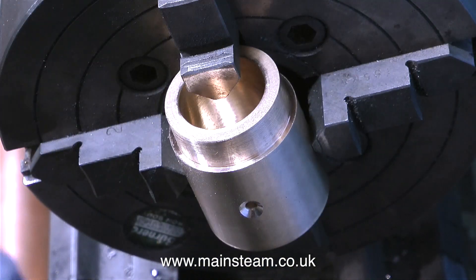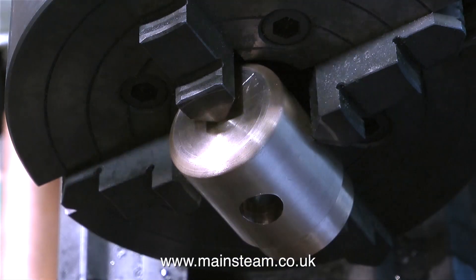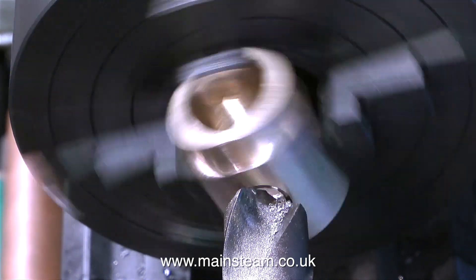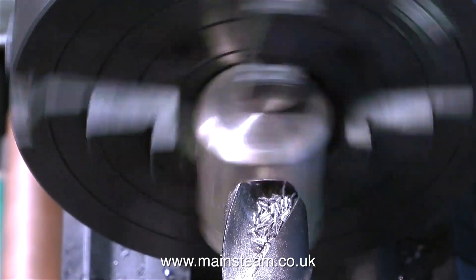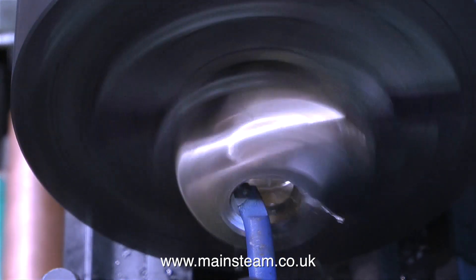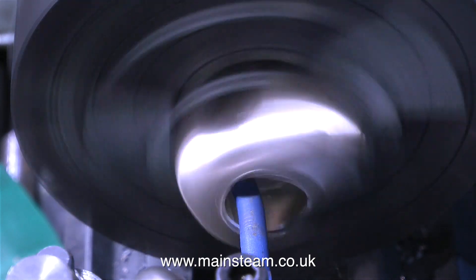It's in the right place. After using a centre drill, I'm using a 5/8 drill to initially drill a hole through the centre of the work — not all the way through, just through half of it. And now I'm using the one-inch drill to open up the hole. I need to bore a hole in the centre to be the same diameter as the external diameter of the chimney, so that the chimney is a snug fit. But trying to use a 1-inch drill is a bit crude and it's going to take far too long, so instead I'm going to use the boring tool, because it's quicker. And in no time at all, I'm opening up the hole in a far shorter time than drilling through with a 1-inch drill.